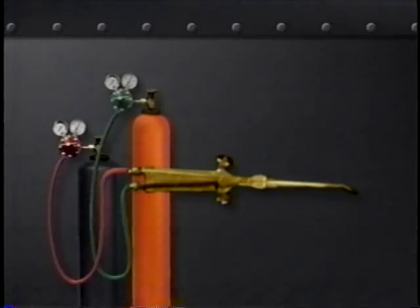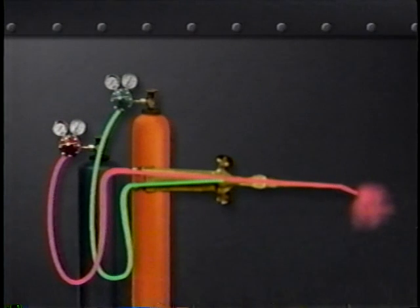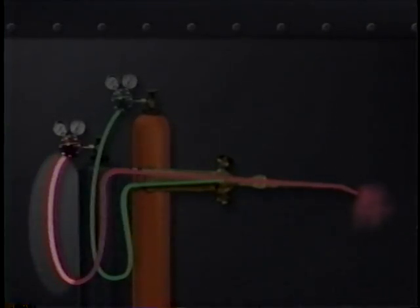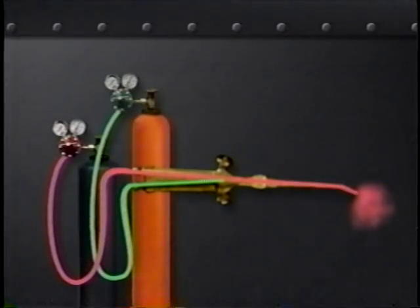The pressure rises, which means that the 50 pounds pressure of oxygen, even though it was flowing out of the tip, overcame the 5 pounds per square inch acetylene pressure in the mixing chamber and caused a reverse flow in the acetylene line. If the check valves hold, Harry would be okay. But if the check valve on the acetylene hose leaks or is stuck open, there would be a mixture of oxygen and acetylene in the acetylene line and in the diaphragm area of the regulator.